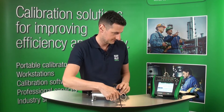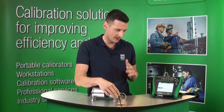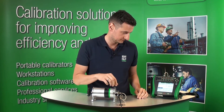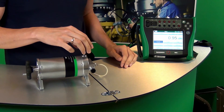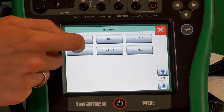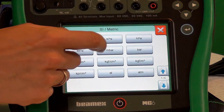I'm going to vent it right now and we're going to apply some very little pressure. Let me close the release valve and go to one millibar — I'm only going to use the fine-tuning here. Let me check how much that is in inches of water. It's 0.4 inches of water. We can go back to millibar again.